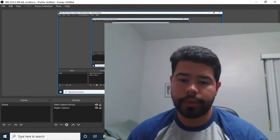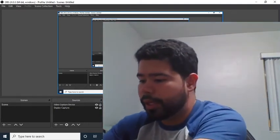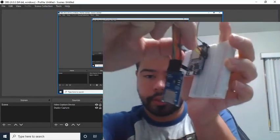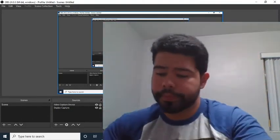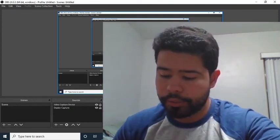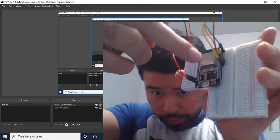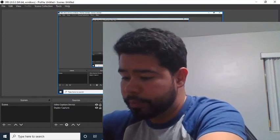As you can see over here, I got it over here, and we're gonna take this up, and we're gonna be plugging it in the little micro SD module, which is this little blue one over here. Just got a good angle. This one over here. You're gonna plug it in, and then you're gonna connect your Arduino board to your computer. So a little LED light should light up on your Arduino, making sure that everything's functional. It's gonna be one of these in the middle, and let's plug it in. All right.